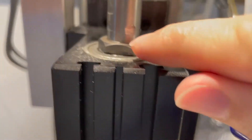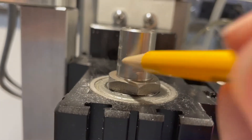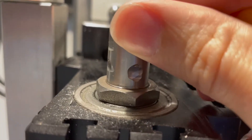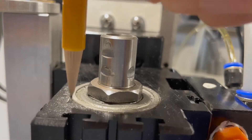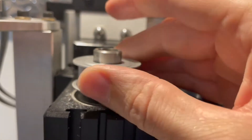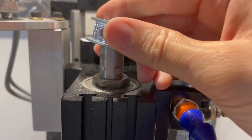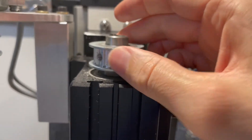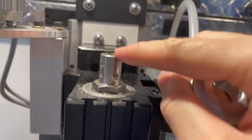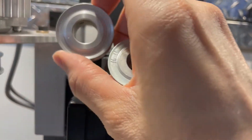Under here, this was the original factory grind for the factory pulley, and then I put marks for the new pulley that touches a different place. They're angled inward, so when you tighten the set screws it pulls the pulley downward. The BBman pulley is a really nice fit. The eBay pulley is noticeably looser, but not that bad — it's looser because this is for 16 millimeters and this is 5/8 inch, so it's about 4 thousandths different. The BBman pulley is an inch pulley; the eBay pulley is a metric pulley.